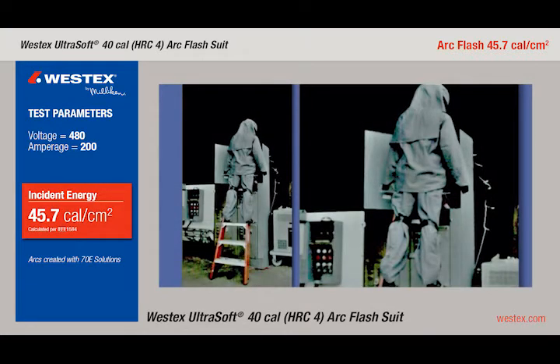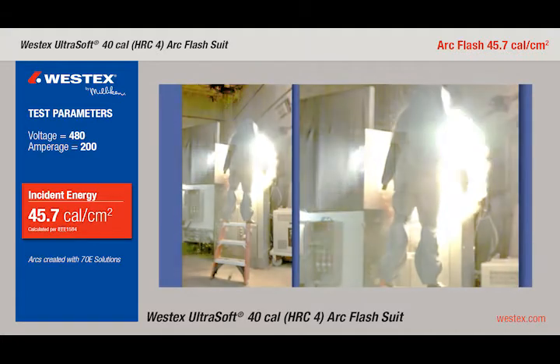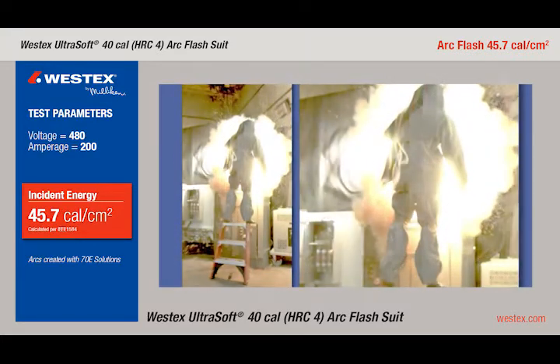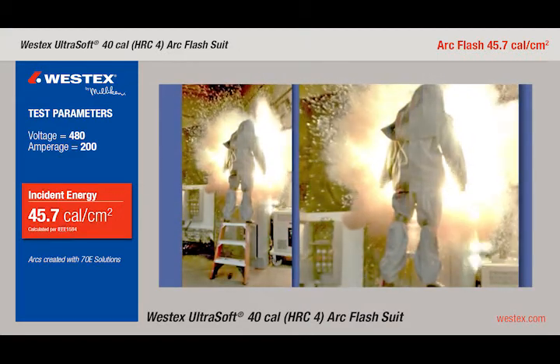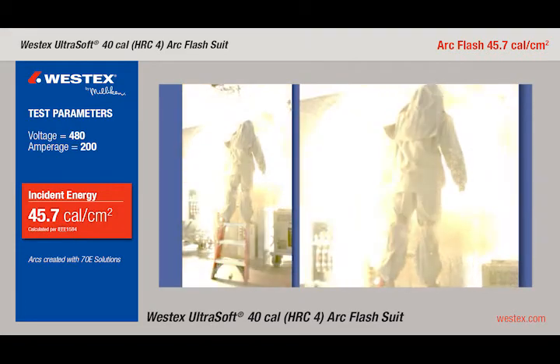We get a look at our split-screen slow motion, and at 3,000 frames a second, this is a 14-cycle arc — you get a great look at the pulsing of these cycles, and you see that the molten metal comes out as a wall. There's a wall of molten metal going in all directions, and the arc eventually defeats the sides of the MCC as well, and we get the arc plasma out to the right and left of the mannequin.